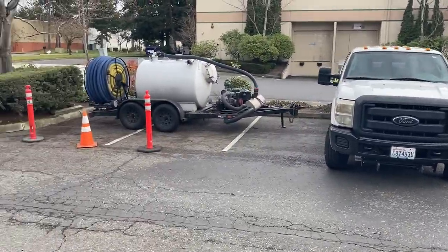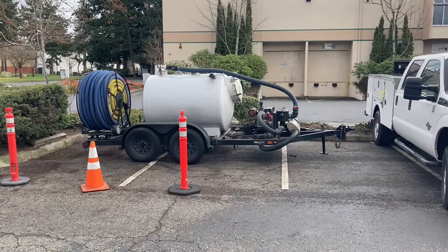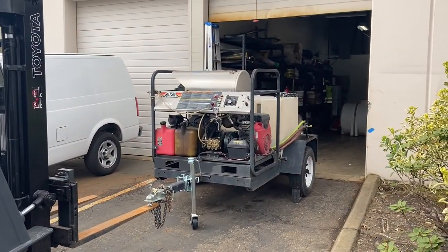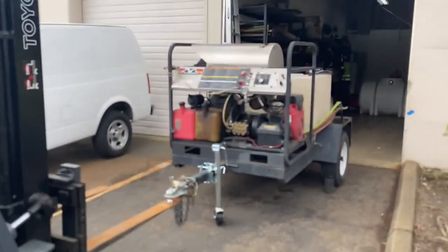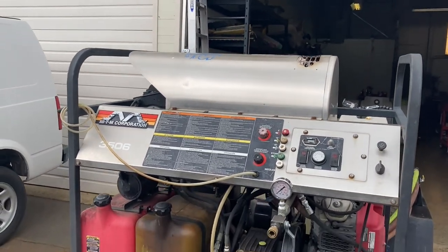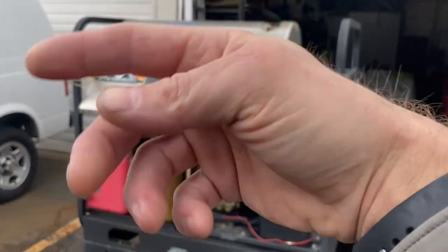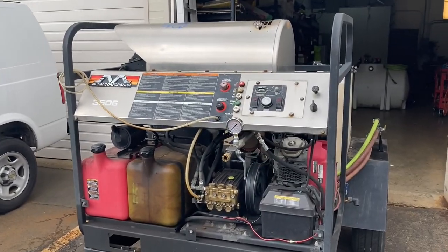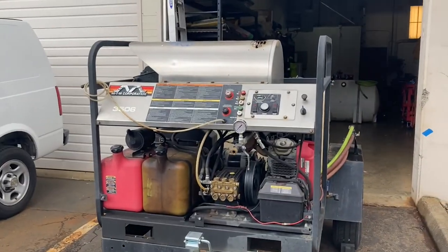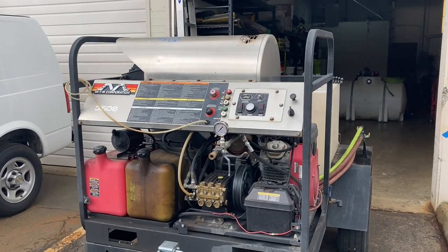That means putting the hot water system in the back of a truck and then having as small a trailer as possible so that you can get around corners and pillars and get into alleys without having too big of a piece of equipment. If you want to have the hot water machine in the back of a truck, like one that you can buy like this one, it's not going to work for a parking garage because, A, it's too tall. The reason is that garages are low clearance structures. You see the burner for this thing, that silver tube on top, that's a steel coil that the water goes around and around in. While it's traveling through that rat maze of pipe, it's being heated up by fire hitting the inside of that coil. But the exhaust for that is right on top. So if you take this skid off the trailer and stick it in the back of a truck, you have that burner sitting right below where the sprinkler heads in the garage are. You'll set those sprinkler heads off, and about 5,000 or 10,000 gallons of water will come down on the floors in about 2 minutes.